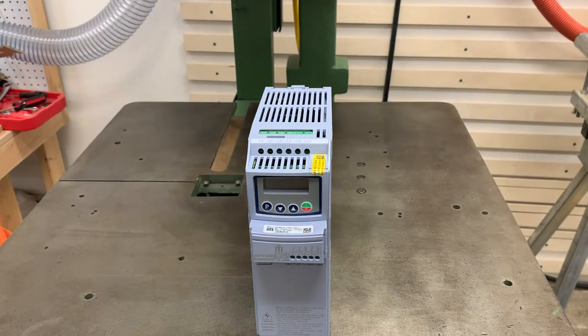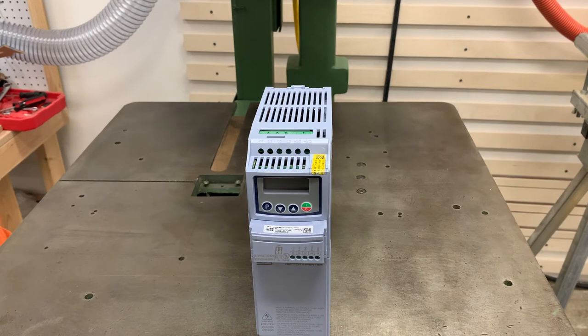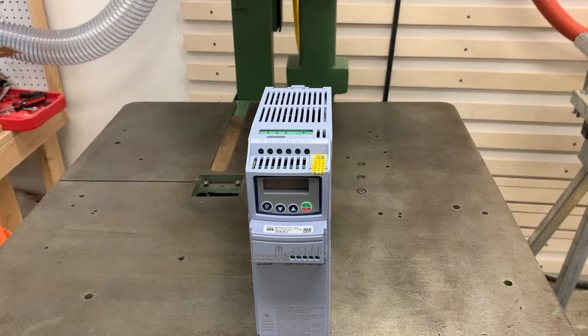One thing that you cannot do with a variable frequency drive is use the existing motor switch between the drive and the motor. If you do that, you will probably blow up your variable frequency drive, especially if you do it a lot of times, because when you break a circuit, the magnetic field collapses and it creates an arc. You can test this by unplugging your vacuum cleaner from the wall while it's running - you'll see a spark at the plug, and that spark can damage the electronics. So what you have to do if you want to use your tool switch is repurpose that as a control signal into the VFD. You tell the VFD when to turn the motor on and off rather than having a switch after the VFD before the motor. I'm going to go one step further and upgrade the ergonomics of the power control for this saw. Northfield actually recommends moving the switch from where it is on mine, which is the back side of the column, and we're going to use some nice modern controls to keep a tool like this just a little bit safer.